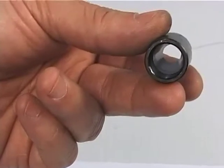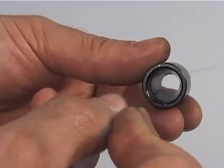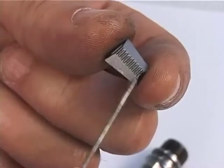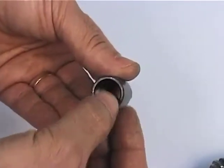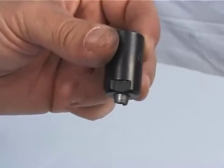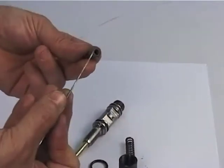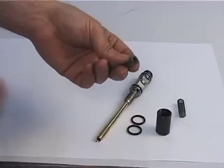Check the good conditions of the clamps holding cone. Check the wear of the clamps and, if necessary, clean or replace them. Then insert them in the relevant cone. As regards the clamps opener, check the wear of its surfaces and spring.